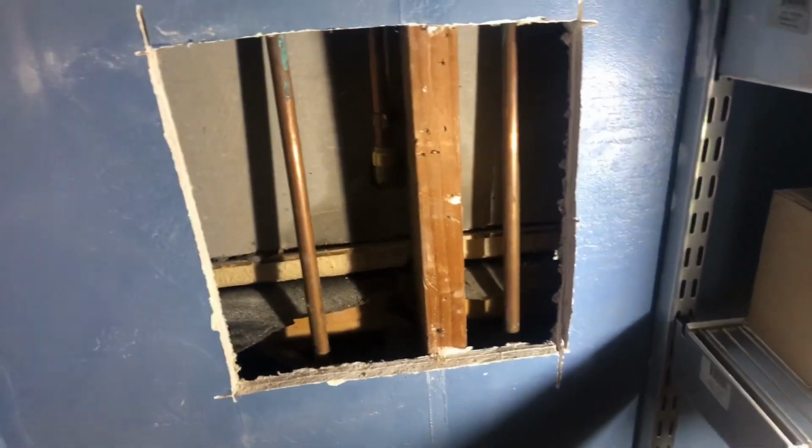When you do a patch like this, you need some way to hold this drywall because I'm holding this with one hand. There's nothing holding that side, see what I'm saying? Even though I could screw into this other centerpiece here. Actually, I got this backwards. There we go, that looks better. So I could put some screws right there, but that's just gonna fall in there.